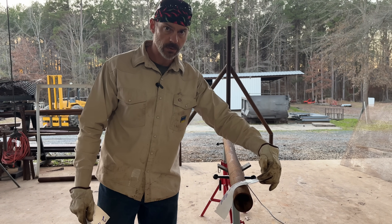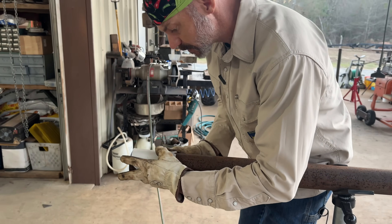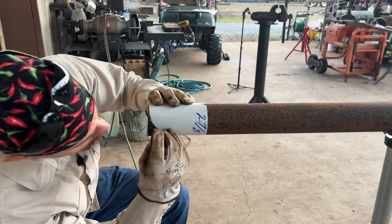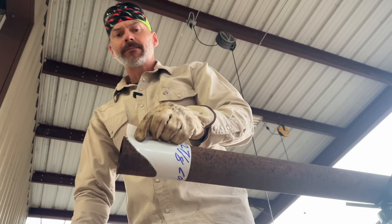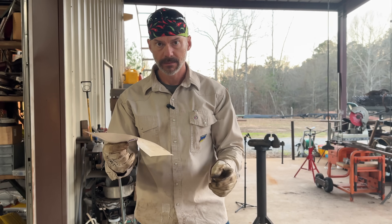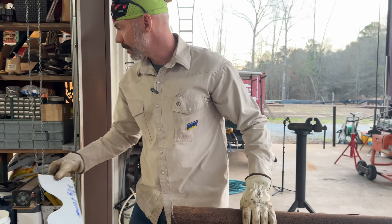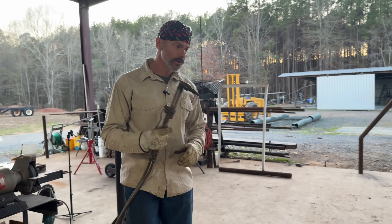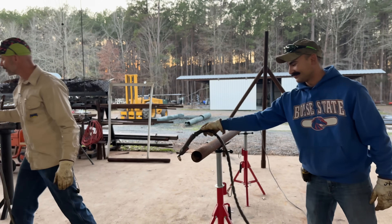Remember, one of the six-footers only gets the corner cope, not the compound cope. I actually prefer the other template that I'm building — I worked on it today. This one does have some crap in it, yeah — this would be a good one for the plasma cutter; it'll make it a lot faster. These templates are Lexan, guys. If you're making templates, this Lexan lasts forever — it doesn't have memory, you can roll them up and it comes right back. It's a little bit expensive but it's way better than cardboard that'll disintegrate in a year or two.